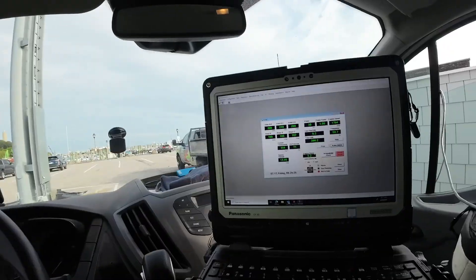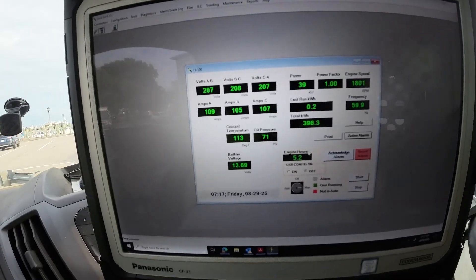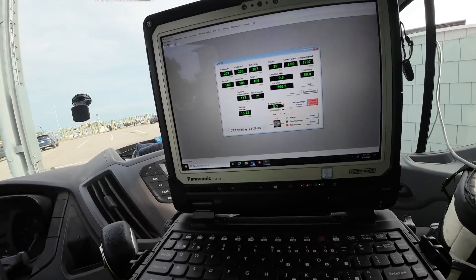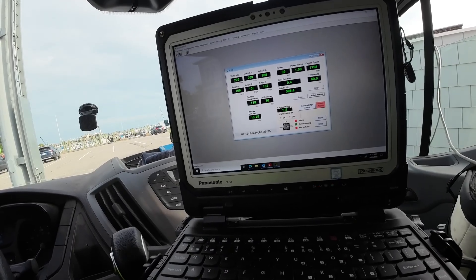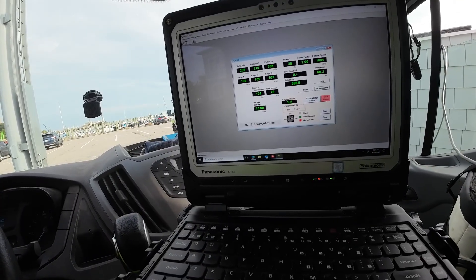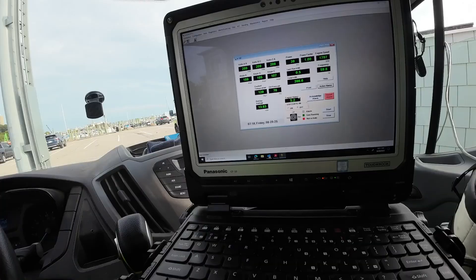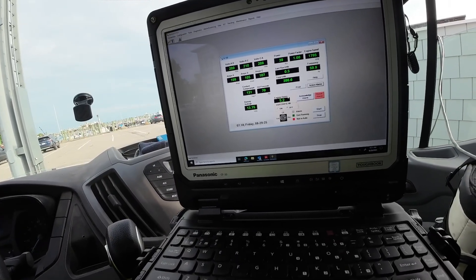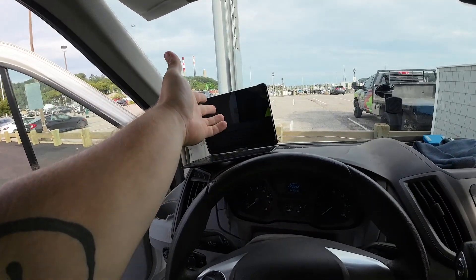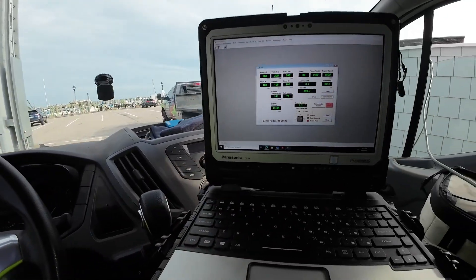How cool is that — so we got about 40kW on that, temperature is 110 degrees. Oil pressure is something I'm concerned about — you see it at 70, 71. Oil pressure is probably gonna drop. I don't know why, but these 9-liters don't like to run with high oil pressure. There's been a couple that I've done where they've only ran maybe 20 psi at idle.